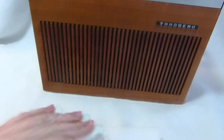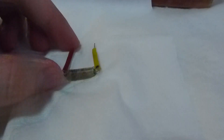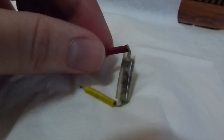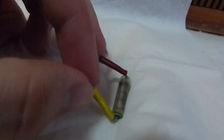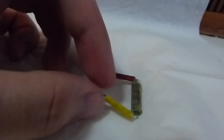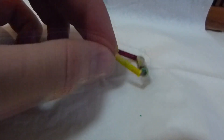The problem that this model has is that the voltage stabilizer — this little cylindrical component here — tends to go bad. I mean almost always. The other one I have has an original one that's working reasonably well. I notice the voltage does fluctuate a little bit, but not enough to give it problems it seems.